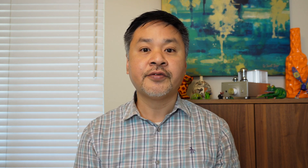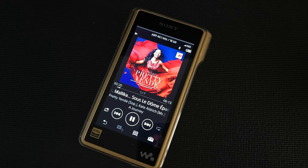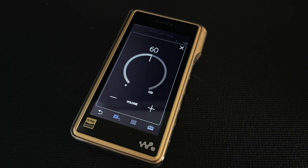So what is the best way to test your amplifier to see if it has enough power to drive your headphone? First, you want to play a piece of music that you are familiar with and set the volume to your normal listening level. For example, if your normal listening level for this music track is at the 11 o'clock position on a volume dial, slowly turn the volume knob to the 12 o'clock position and then carefully listen to see if the sound quality is impacted.